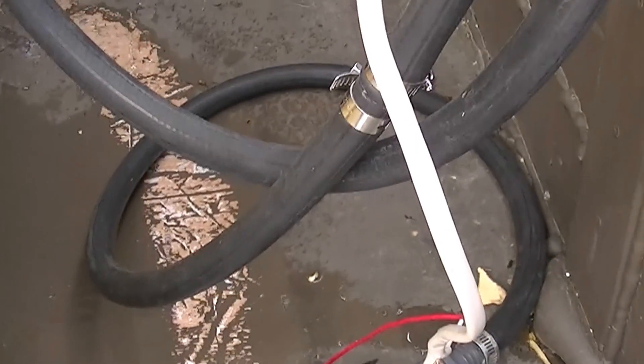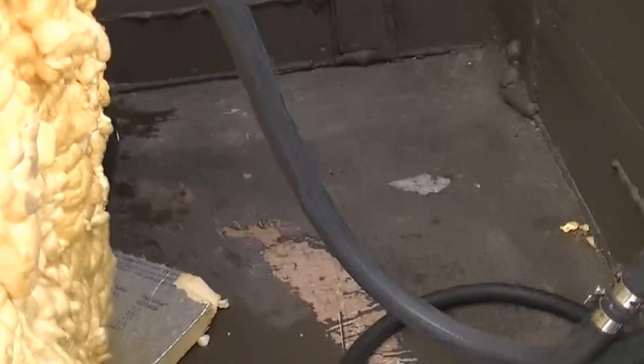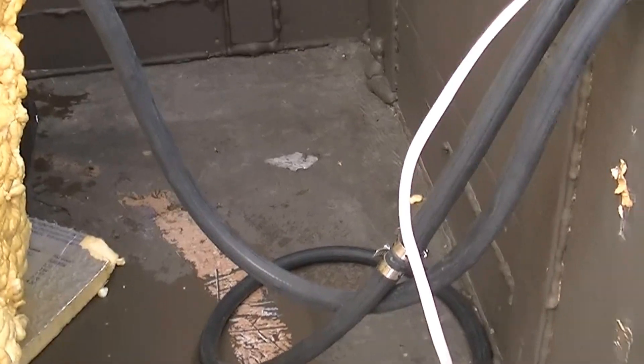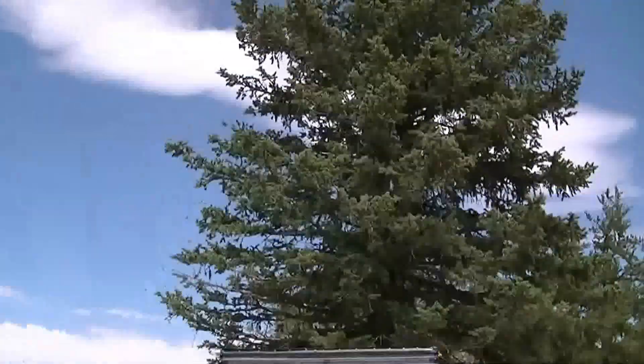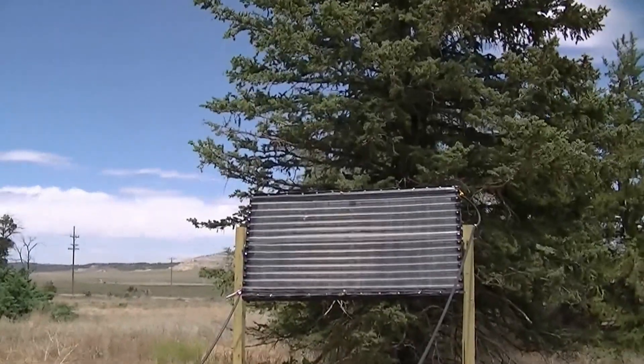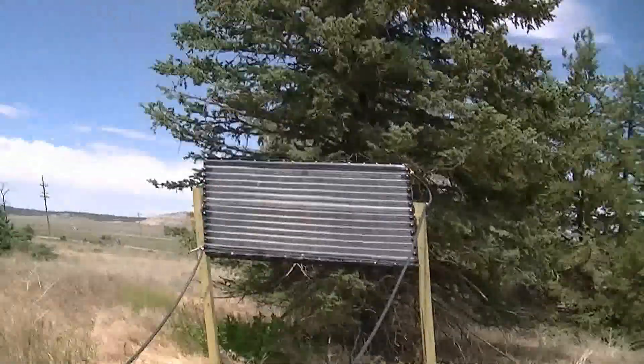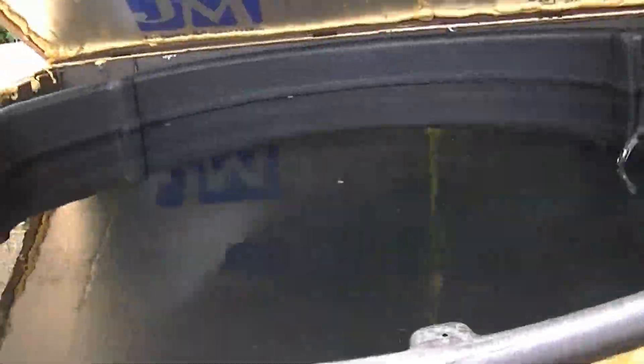You can barely hear it, very quiet. And there's the good stuff coming out of the hose. Remember how this is set up — just got an inlet and outlet. Out of the bottom there is what's coming out of the tub — colder water at the bottom, getting pumped by the pump up into the lower end, which would be the bottom left of the solar collector.